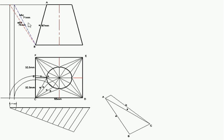Put my compass on point C, draw myself an arc. The length from point A to that point there, we've worked it out here as 9. I set my compass at 9, draw myself an arc to get that point. Next step, I want this little triangle, which is this one here, the one that we've got on B.